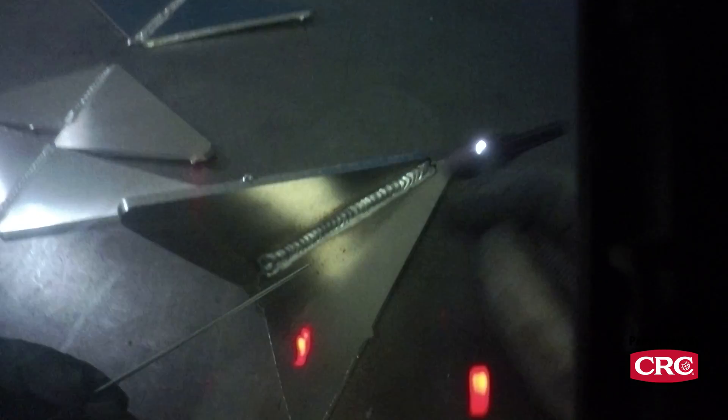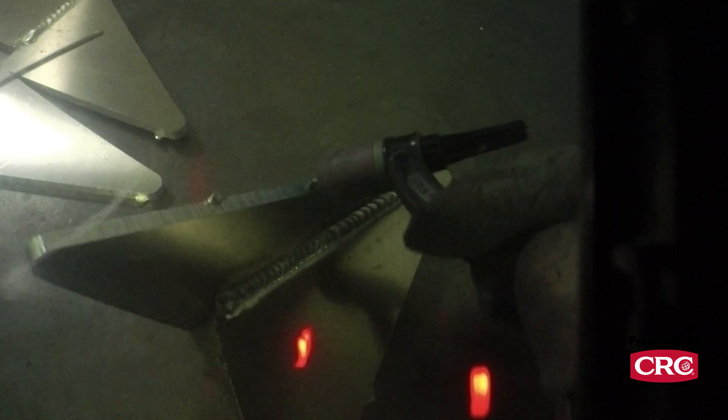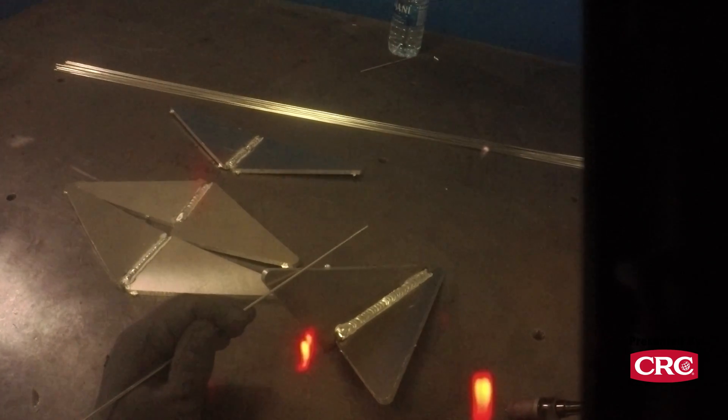See it floating up to the top? That one came out really nice, but this one came out a little dirty — you can see this spot where it had some stuff floating to the top. Aluminum likes to grab the dirt and let it flow to the top, and that's how it makes your welds look like that. That's how you get a nice set of dimes — just move a little, add a dab, move a little, add a dab.